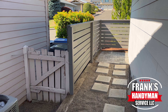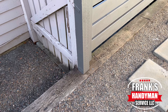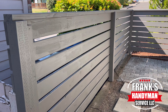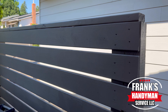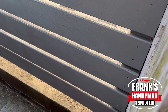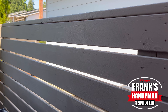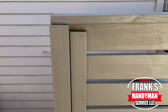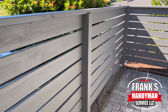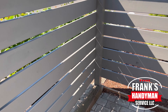That's pretty much the results right here. After we installed the fence section, we had an L-shaped layout and it stopped right here where the previous one did. We attached it to the post just like the other one — we have brand new brackets at the bottom, the top plate there, and the two by four on top. We put a two by four next to this four by four post so we can attach these long sections — I think they're 10 feet long — with four screws each, or in the narrower area, two screws each. That's how you secure everything. This is a brand new modern wooden fence and the homeowner was super happy with these results. It definitely transformed the look, and especially since this is in the front of the house, you'll want to keep this in mind for the curb appeal.